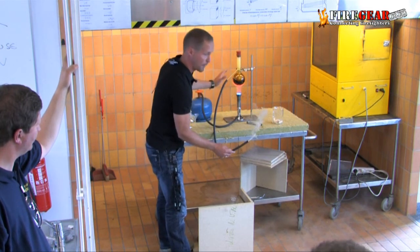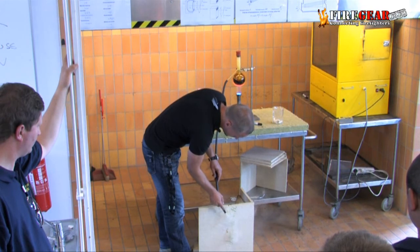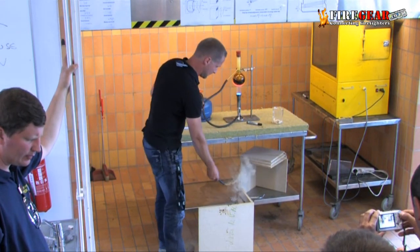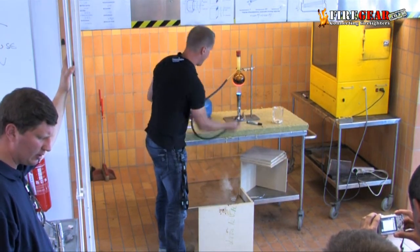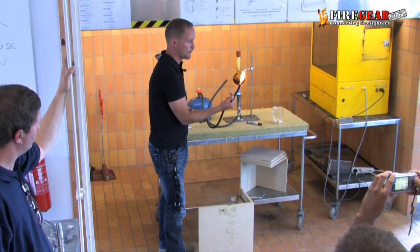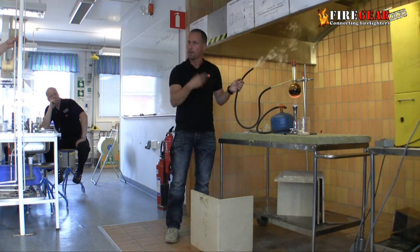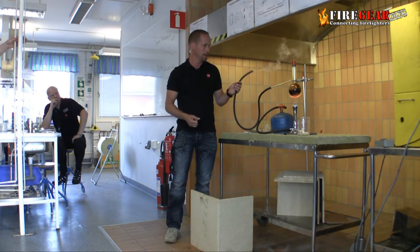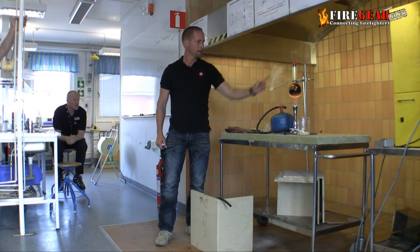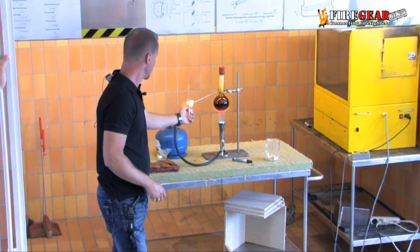Still some water — most of the water is probably gone, but there's still some coming out. The water is being mixed with more and more tar; you can see the color of those droplets — dark brown, yellow, a lot of tar. The quality of the gas is getting even better. A very nice flammable gas is being formed. I'm going to continue this process for a couple more minutes so all the wood is broken down. If I ignite it here, isn't there a risk of flashback and explosion in the glass? No — it's completely free of oxygen, so no problems igniting it; it won't flash back.